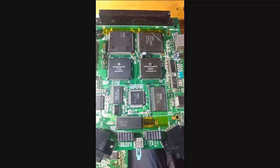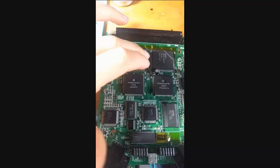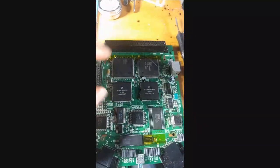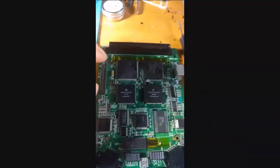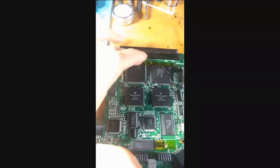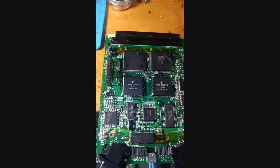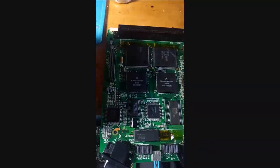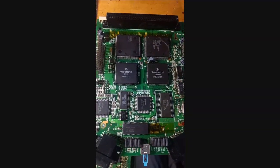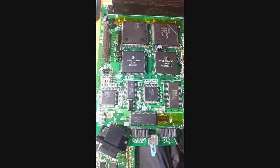So the first thing I had to do was replace the whole chip — and that's a really hard job. You have to get this board amazingly hot to do any reflow work because it's a four-layer PCB with a lot of copper on the internal layers. It took almost 10 minutes to get it heated up enough to remove the chip. You also have to worry about board warping, so I had to do a very long cool-down period with carefully monitored temperature settings. I don't recommend it for amateurs or anyone new to professional reflowing — not using a hairdryer, I mean professional reflowing. Very tricky work.